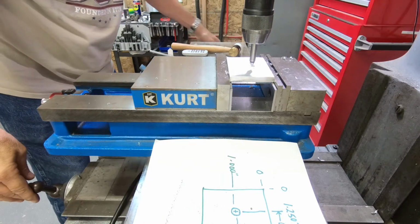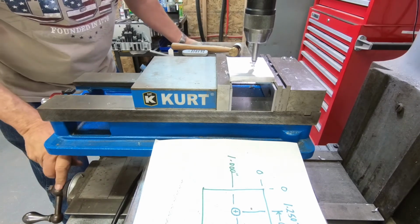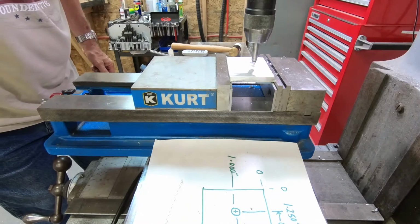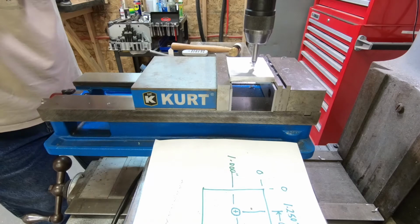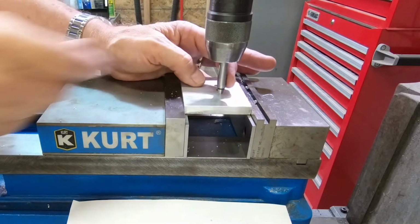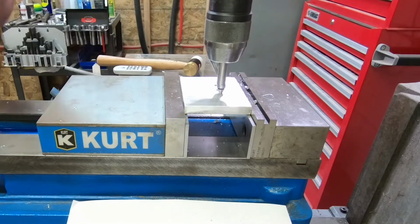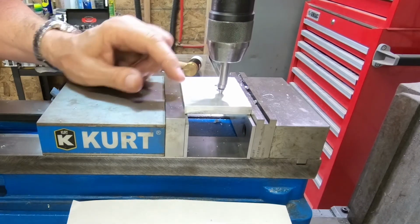And I'm going to steer the table over until I can set the cone in the hole. Now this requires that your hole have good sides to it. I mean, it can't be a real ratty hole, but you notice that it sets this off. And what I can do in moving the table, you see that it is going to slide back and forth.